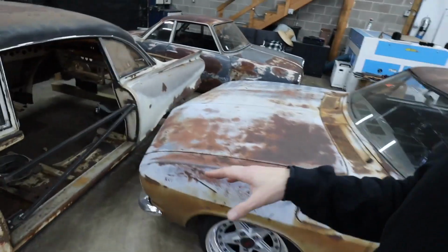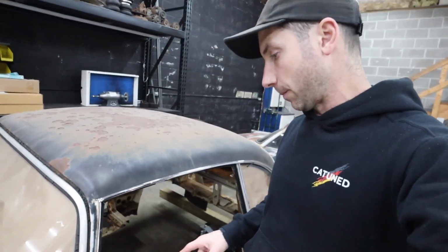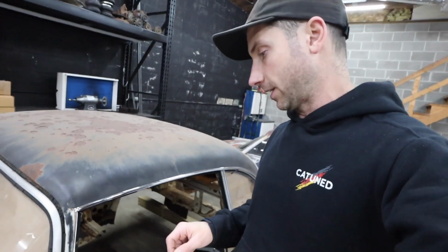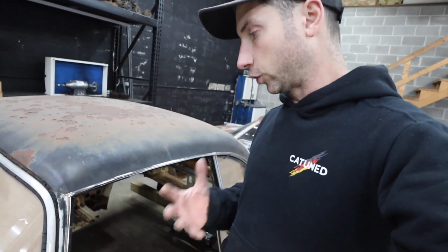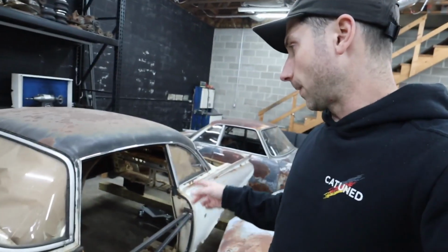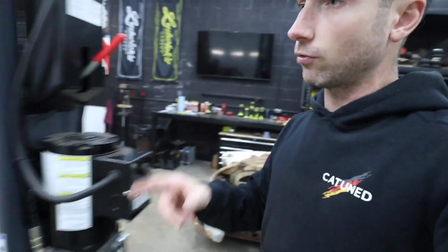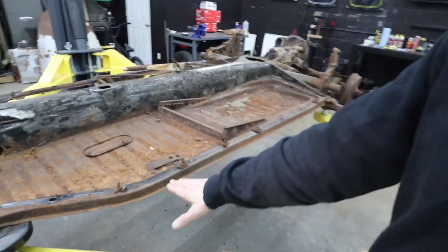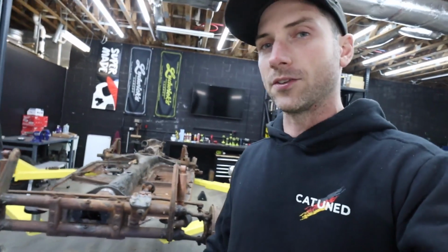The floor pans in the body haven't been fully cut away yet. If you remember from those episodes, I was taking out little by little because I didn't want to shoot myself in the foot and take too much out of there, and ultimately wished I'd kept some. So now that I've gone this far, I basically know I need to cut everything out. So the body isn't ready to go down over the pan to where the floor pan levels will meet up, but we'll get pretty close and get an idea of what else needs to get cut out.